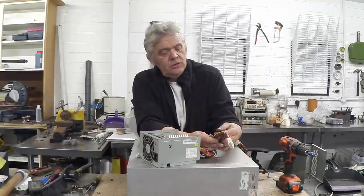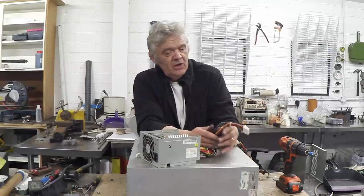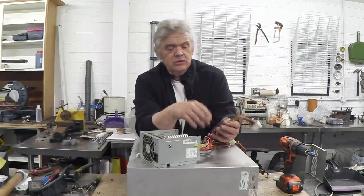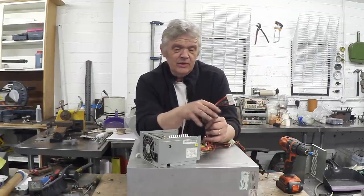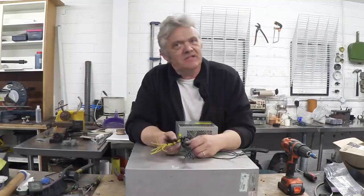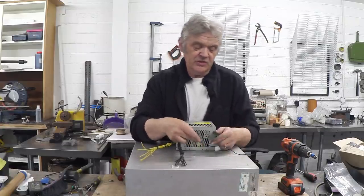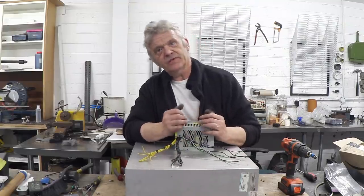You don't need to use the grey and purple wires, but if you've got them why not - we'll wire a couple of LEDs to them to get an indication of the state of the machine. All we have to do is cut off the ends, clip out the ties, and gather them together. The ones you don't want you can terminate and leave dangling; the ones you do want we'll put onto a proper termination. There it is - all bundled up, snipped off, making it much easier. That's your neutrals in black, your 12 volt positive in yellow, your on-switch wire, and a couple of indicator light wires.